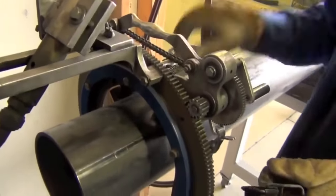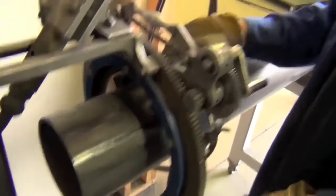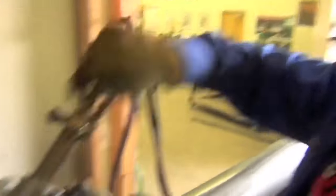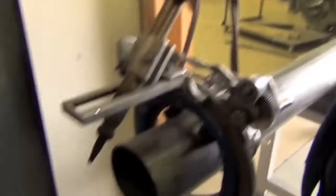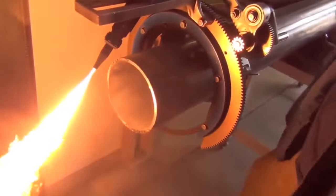What we're going to do is go ahead and heat this pipe, crank up the torch, heat up the pipe, and cut us a perfect bevel. I'm always going to wear the proper PPE — I've got shade five cutting lenses. Put those on, turn on the gas, start it up.